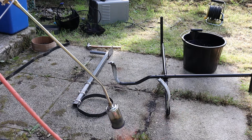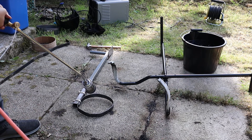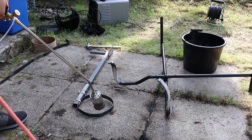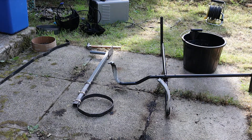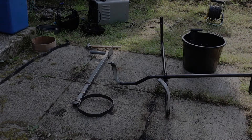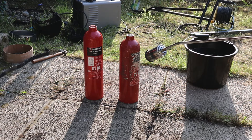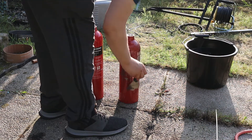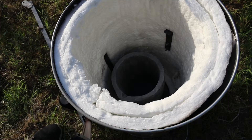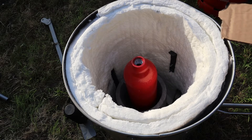I also blasted a few bits of grass and blew some holes in the concrete. Tools made and crucible tempered, we're good to go. A friend gave me two cast aluminium fire extinguishers that I could melt down. All of the aluminium I've got so far is either from extrusion or from cans and therefore not great to cast with. I thought I could melt these fire extinguishers down and throw some of the cast aluminium in with the pure aluminium to help it cast better.